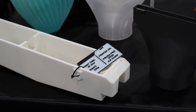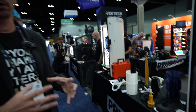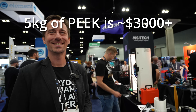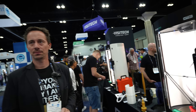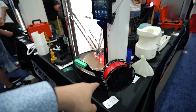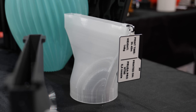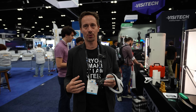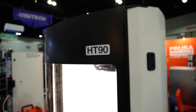We're really curious where this will expand the possibilities for engineers. While you can print full objects filling the chamber with polymers like ABS, PC, or ASA, it's mostly small to medium-sized parts for these high-performance polymers — given their properties and also their price. You don't want to be printing a 5-kilogram PEEK part. To summarize: going from 60°C to 90°C, you get more out of traditional plastics, a wider range of polymers, much better strength, and you can print larger and more complex geometries. Whenever a user is getting the HT90, it's not just because they want a print output — they also need mechanical performance.